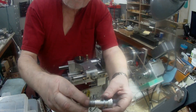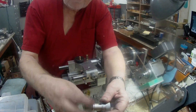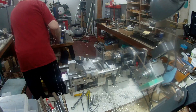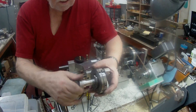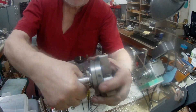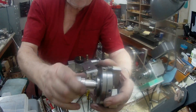If I was to screw-cut a nut, I'd think it would probably run nice and true. I'll try it in the three-jaw chuck. There's a bit of slack at the start, but as it goes towards the end it's tightening up — it gets a nice fit there. So there's a little bit of a taper on the core, I guess. But there you go.